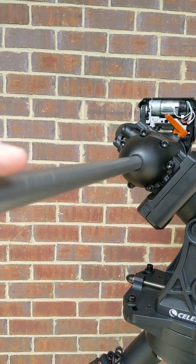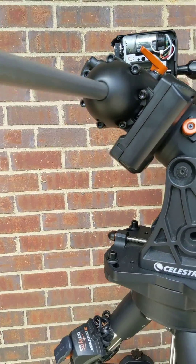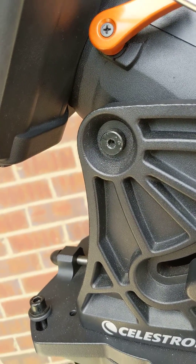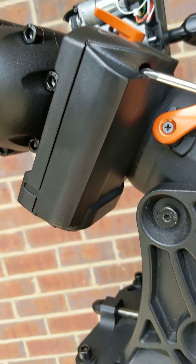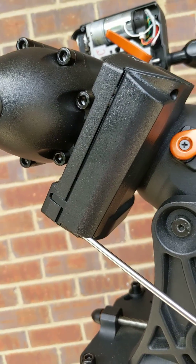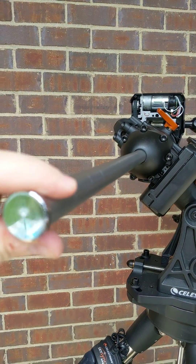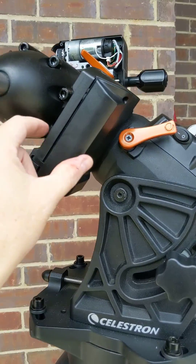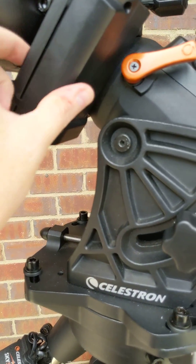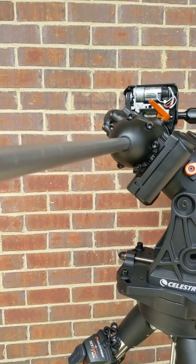I wondered: is the same thing going on here? Let's get in there and change those little setting screws and tighten that up a little bit. Loosen the screws on this — you start to see that back off a little bit. Same thing down here, loosen that up. See how that case is separating? Backlash is gone. This case is so tight up against that worm mesh that when you tighten it up, it pushes it in this direction, thus creating that slop.